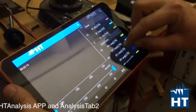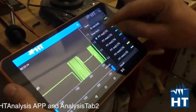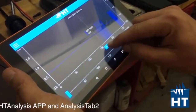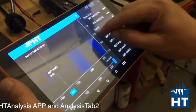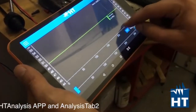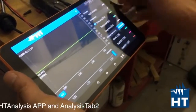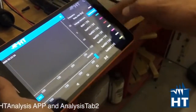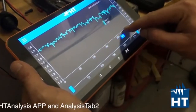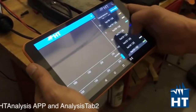We can do a lot more. We can see the power factor — it is floating because I think I switched it off. The power factor is pretty stable at around 0.59 to 0.58. You can also analyze the frequency, which was pretty much stable from 49.98 to 50 Hz. These days the frequency is not always stable at exactly 50 Hz. And you can see the THD — total harmonic distortion — of the voltage, for example, which is pretty much stable. Then here we have all the harmonics of voltage, and so on.